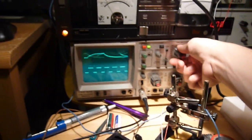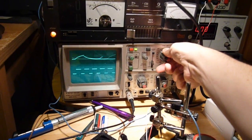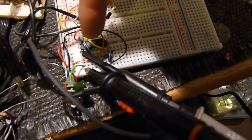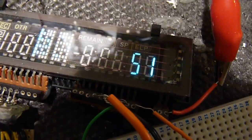That's the power line. If we knock down the time base a bit, the noise has changed. This is the frequency coming out from the 555 timer — that thing there with the green cap — and the green wire is the frequency. We can see the probes to the frequency counter and oscilloscope, and the other traces measuring power. There's a filter cap filtering out the noise so it can automatically count, as you can see here. It's showing 51. If the noise is going then it just malfunctions, so the noise base is not perfect and still needs work, but it's better.